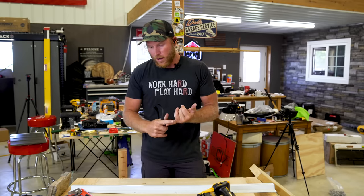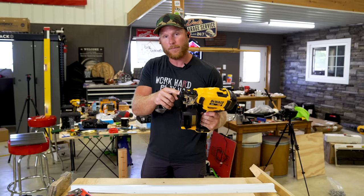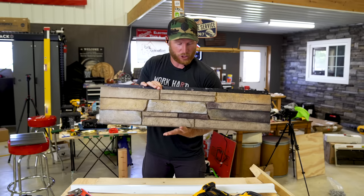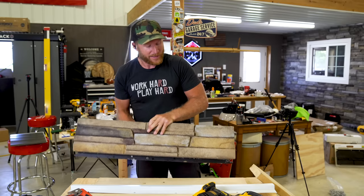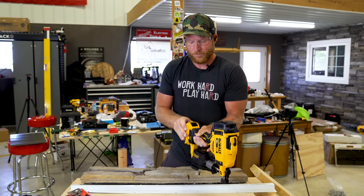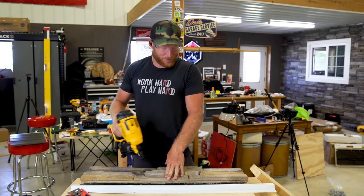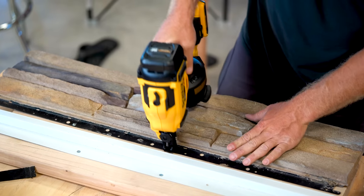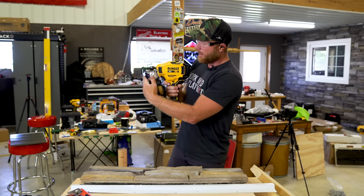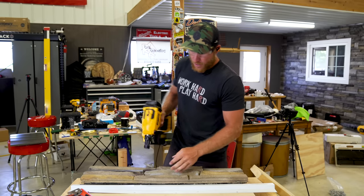That's awesome. Setting a window, that would be great if I can get it to not set that nail too tight. Maybe DeWalt will come out with a placement tip for vinyl siding. That would be awesome. We like to install Versetta stone. You guys have probably seen it on the channel. It's an awesome product that goes up like siding. It's got a metal fin on it. A lot of times we'll have to either screw it or pound a nail. And it's just one of the things you don't want to have to replace a piece, because at like 20-some bucks a piece, it's pretty expensive. And that's nice because there's enough depth in my tool that I can come straight in and hit it. So it's not impeding anything to hit on this stone.